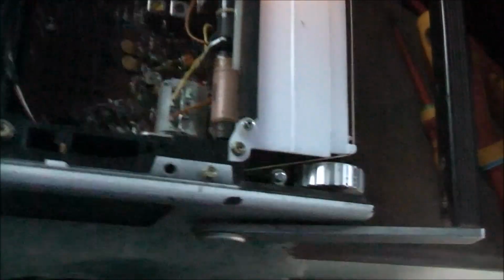Alright, now I'm going to have to put the front half of the unit back together. That's done. I'm going to put the front half back on. The instructions are here, which is really cool. You've got to undo 3 of these long screws, and that comes off here, here, and here, and it just pops up and lifts off. Then there's 3 screws here, here, and here, which your dial fascia comes off, and the back comes off in a very similar way. It slides. Very nicely built, this thing. I do like it. Nice heavy duty tuning capacitor too. Good stuff.